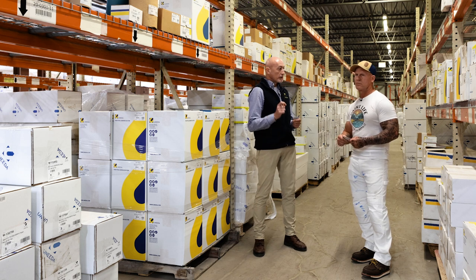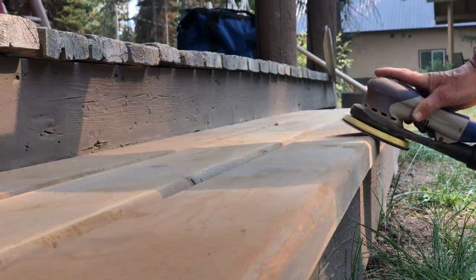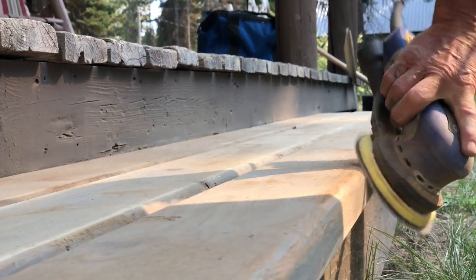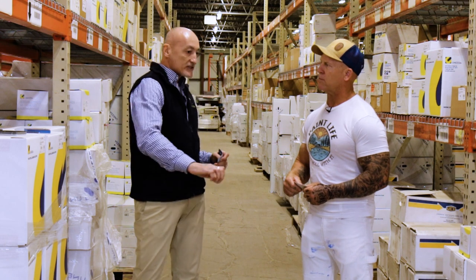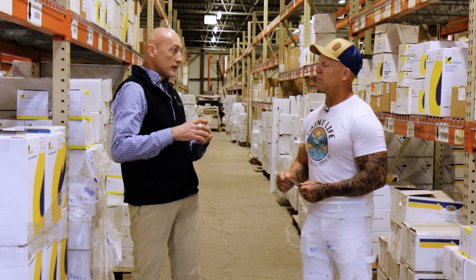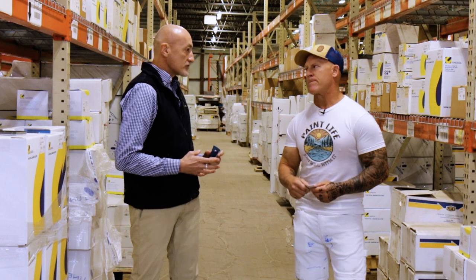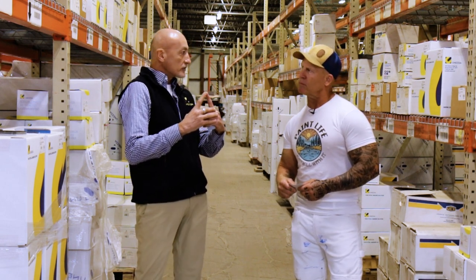If you're using a three-by-four sander or a five-inch sander, just let the weight of that machine do the work. I get it — if I'm doing drywall, I'm going to town at it, but I'm creating a lot of friction. Just letting the weight of that sander do the work is going to do the job. These tools are designed to crack and resharpen — that term in the industry is called friability, and that is a major term in our industry.